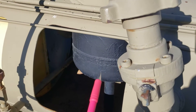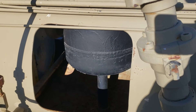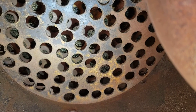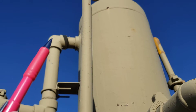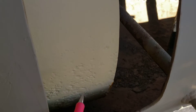You can see the bottom of the gas dome and all that pitting right there below the weld — that would have been right at the oil-to-water interface elevation. A lot of corrosion. I'm putting my flashlight inside the gas dome, the communicating chamber, so you can see the inside. You've got the dump float right there, and looking up top you can see the perforated support plate. Past that, you can see the mesh of the demister pad — that's to get all the last moisture to drop out so the gas going out the sales line is as dry as possible.